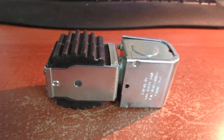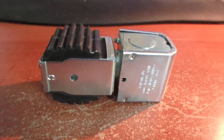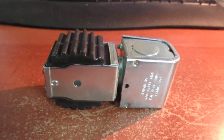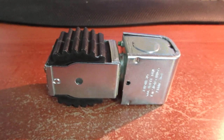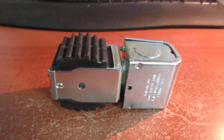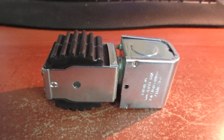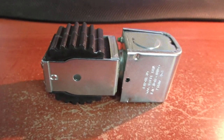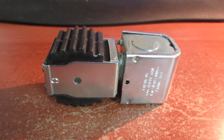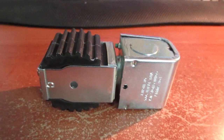One thing I wanted to add about the associated part — the valve that this coil sits on top of — that valve is usually susceptible to getting sediment and blockage caused by sand and debris. So what we use is a Y strainer, and the Y strainer will help eliminate the problems that you get with the DEMA solenoids.